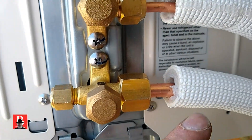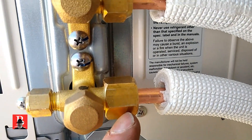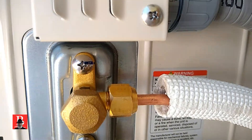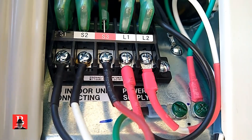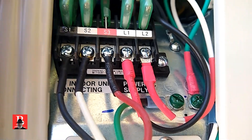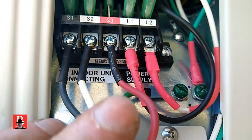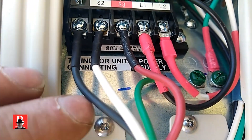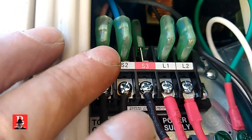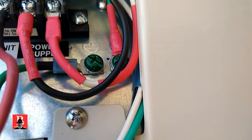One of the things you want to make sure before you put the nut on is that you get that flare mechanically centered on that joint, on that end. Now wiring is done — it's pretty much matching the colors: black and red, or black and white if you want. I marked mine red to show that it's not a neutral, and then black, white, red for the communication going up. And there are two grounds right there.